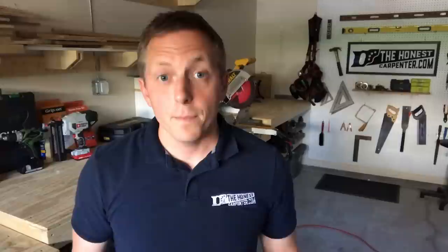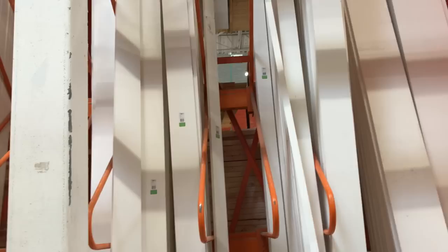There's no shortage of materials out there that can be used for shelving and built-ins. Full plywood sheets can be broken down, MDF planks can be purchased, melamine boards are available, and you can always just get surfaced wooden boards. But the most useful material, in my opinion, is the one that people always overlook: pre-primed pine. It's generally stocked in close proximity to all your other options, and it's milled to dimensions that make it perfect for shelving and built-ins.